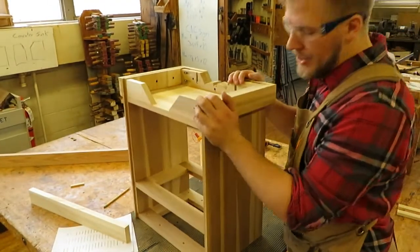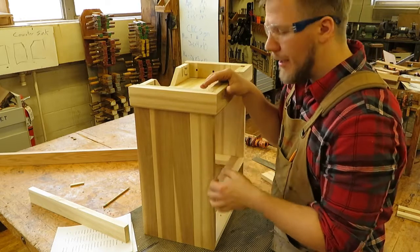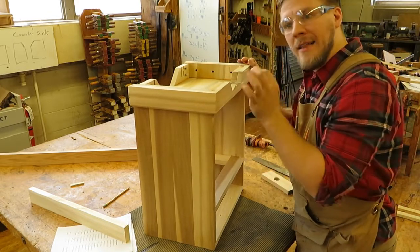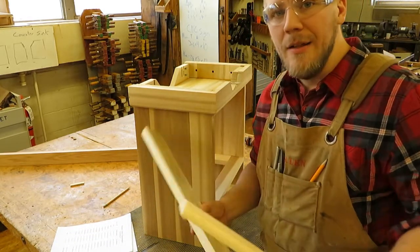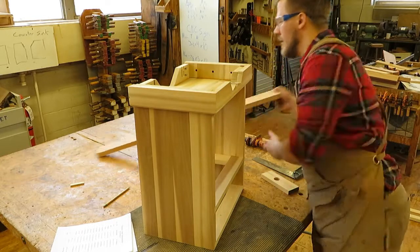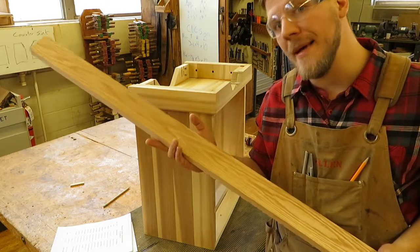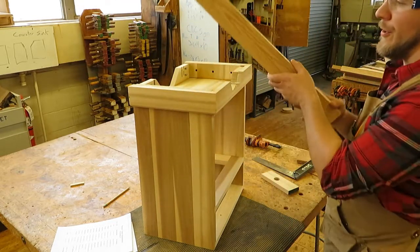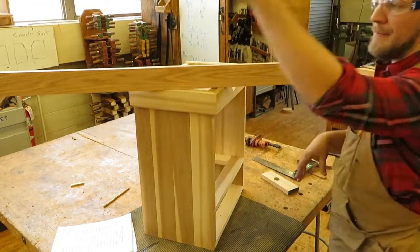One last critical thing, just like the web frame and how they all have to be the same exact thickness, when it comes to doing a miter joint, it is absolutely crucial that all parts involved in the miter joint are exactly the same thickness. So what I would advise is that when you're making your miter joint pieces, you run them all in the same planer at the same time, or you calculate it out for the rough measurements. You can take it out of one longer piece of wood, plane that piece down to exactly 3/4 thickness, then run that larger board through the 6-step squaring a board process, so square up the whole board, and then out of that board cut your exact pieces for that project.